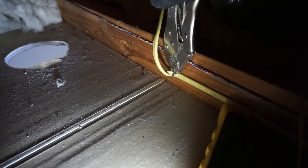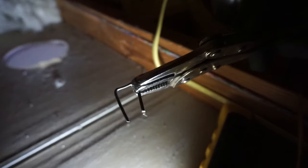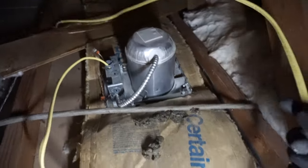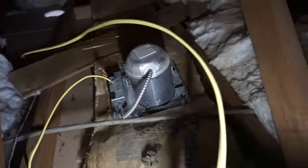Just like that — goodbye, can lights. I like using the vice grips on these staples to just take them off. Here is one of the can lights — I like to save the wiring on these, especially when it's long. These don't come cheap, so this is about 10 feet of 12-2 wire that I can reuse somewhere.